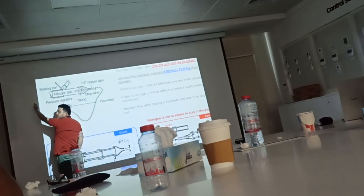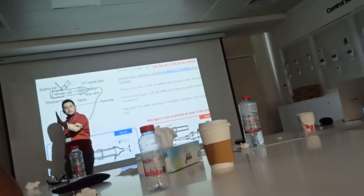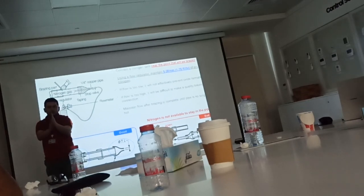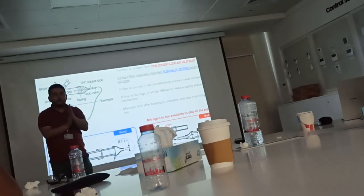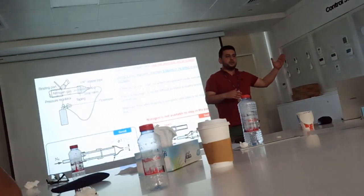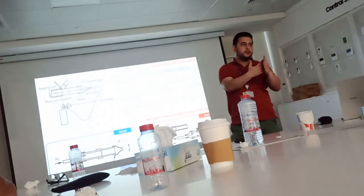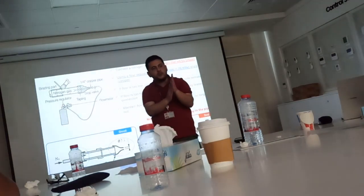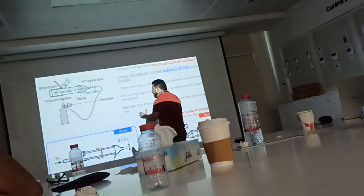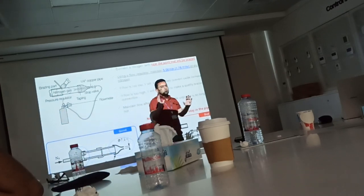The flow should be sensed 10 cm away from the pipe, not only at the pipe. When you hold your hand 10 cm from the pipe, you need to sense the flow hitting your hand. Okay? Which means medium flow. Also not more than this. More than this means the flow is far too much. And if it's not hitting your hand at 10 cm, your flow is too low. So make sure that if you feel the flow after 10 cm, your flow is correct in the pipe.